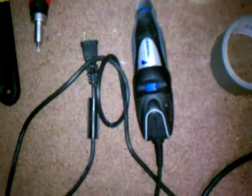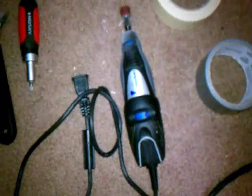You're also going to need a Dremel rotary tool if you're going to cut it yourself to clean up the edges. We're using one with a little sanding drum here. Put it on a really high speed. That way your sanding drum will actually heat up the plastic and tend to make it smooth itself out a little bit better. It will kind of heat up, melt it, get nice smooth edges. And like I said, just use a decently high speed setting. Too high, it might bounce off the acrylic, but set it for about medium to medium high.